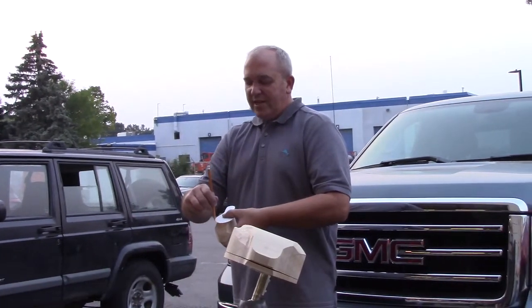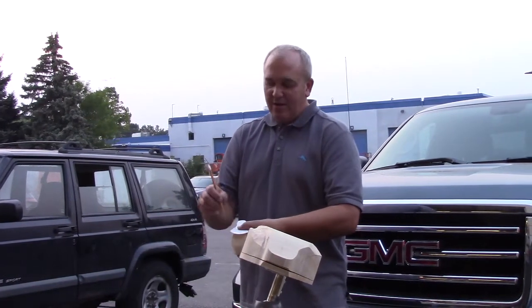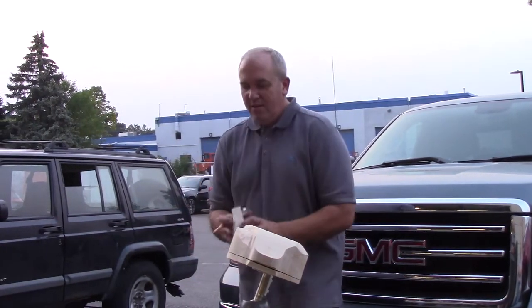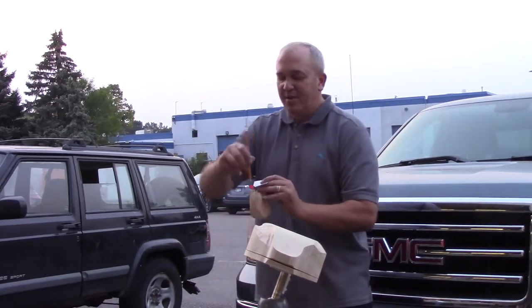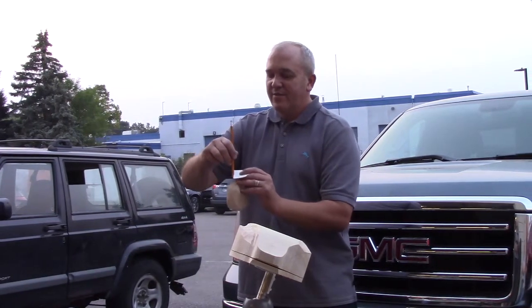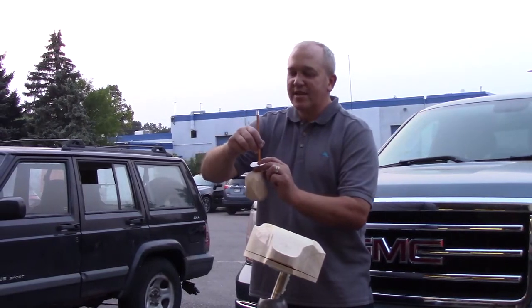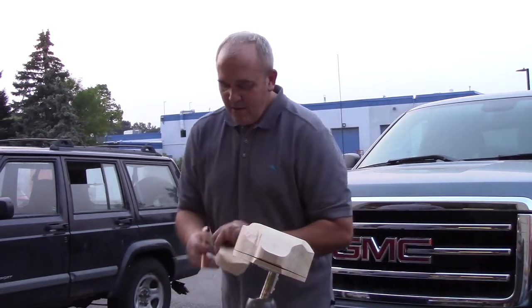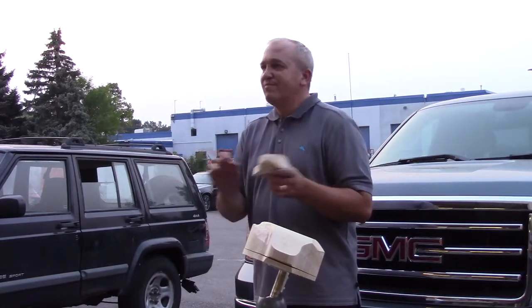So cutting the body out, I'll start on the top, coming in this way over the top, do a stop cut, back out, the other side, stop, back out, do the front, stop, back out, so you're still in block form. Then I'll turn it over on its end like this, and come in on the top through this little eye channel and onto the cheek a little bit, stop and back out, do the other side in, stop and back out, still in block form, and then come back and cut the side profile out. You can cut that all out, whole thing.